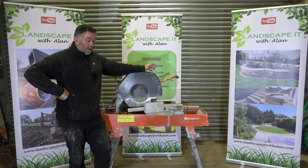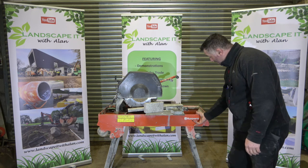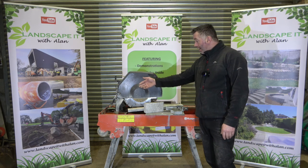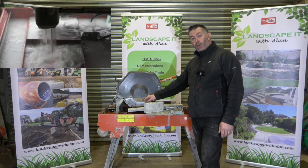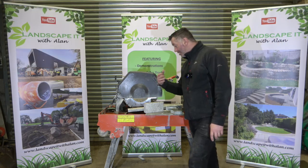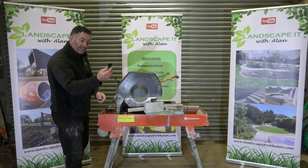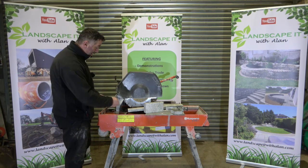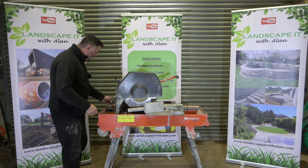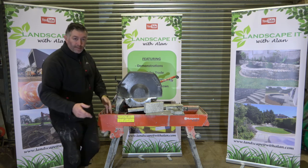So let's look at some of the features and the workability of a machine like this. This main body of the machine has maybe a 100mm depth, and that's the reservoir for this machine, as this is self-containing of water. It has an irrigation system which irrigates the blade to not only keep the blade cool, but also to keep the dust down, and it sprays out quite a fine mist of water. That containment area needs to be cleaned out daily. There's a rubber bung in the bottom of the reservoir that can be removed simply, letting you flush out the whole body of the machine. Sometimes the residue will get a little bit caked, so you'd want a paint scraper or a trowel to remove it — collect it in a bucket so you can dispose of it properly, not let it into drains.